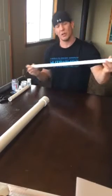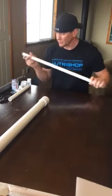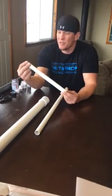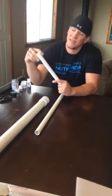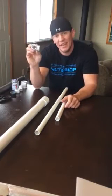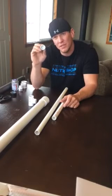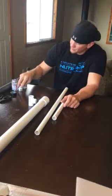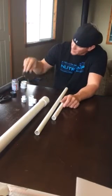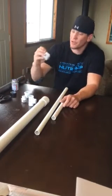Second, you're going to need your plunger. We're going to build the plunger using three-quarter inch PVC — I went about 35 inches, one inch shy of the body. You'll also need another piece of three-quarter inch PVC for the tip to get in there and suck it out — we'll cut this at an angle later. You're going to use a three-quarter inch T for the handle, a three-quarter inch threaded cap to hold part of your plunger together, and an MSA — a male slip adapter — three-quarter inch.